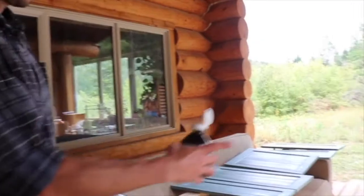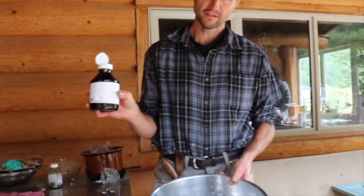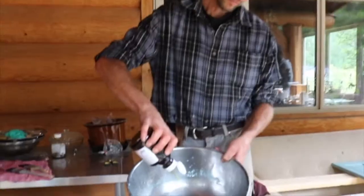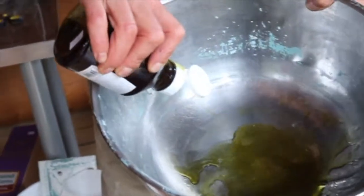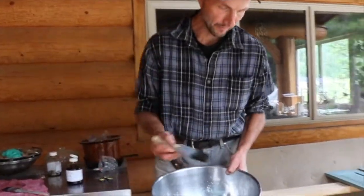This is a demonstration of the milk paint cabinet doors and drawers. We're on our third coat of oiling, just going to oil the sides here — two coats. It's a hemp oil from Ontario; the seeds are grown and the oil is pressed in Ontario. It's a beautiful finish — it's a sealer that goes on the milk paint after you're done, and it helps in areas like a kitchen where you want to wipe the cabinets for cleaning and protecting the milk paint.